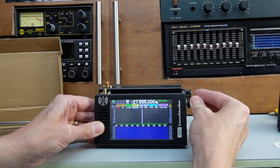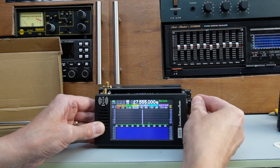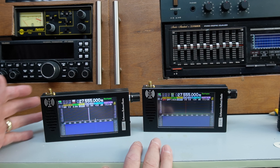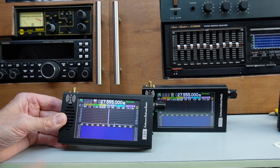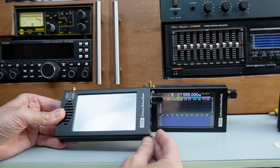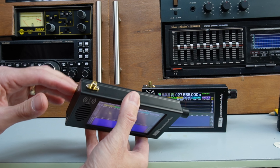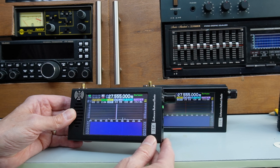To get through all the options, you just press the encoder and then choose from the options — we'll have a closer look in a minute. It's a little bit clunky in that respect, but for 50 quid I forgive it. Looking at the units, I can't see any changes over two years, which I don't think is a bad thing. It's nicely made — the screen is very sharp and clear at 4.3 inches, 800 by 480 pixels. The bodywork on the radio is very tough; I've dropped it a couple of times and it's been absolutely fine. It has a metal aluminium chassis.